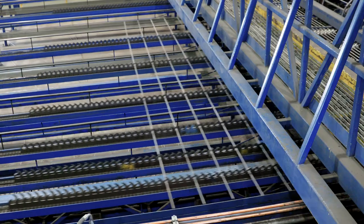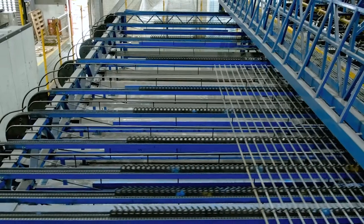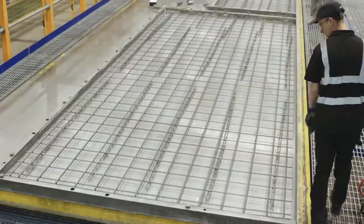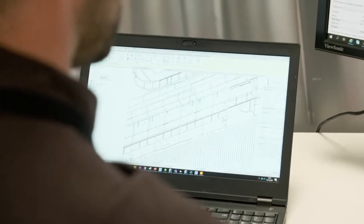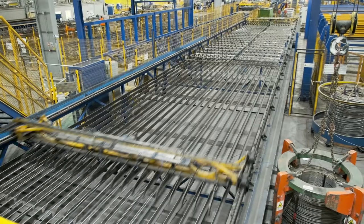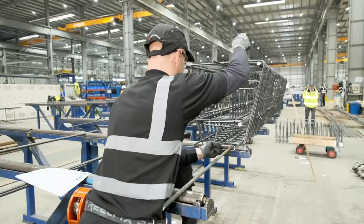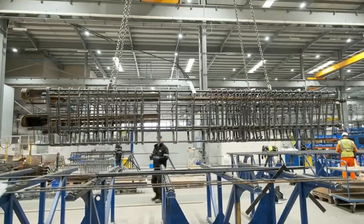The mesh machine is a key factor in our innovative approach to creating reinforcement mesh and cages for our products. The machine produces custom manufactured reinforcing mesh for all areas of the factory. All mesh produced is bespoke for a specific product, and our design office can only detail reinforcement that the mesh machine can manufacture. It produces flat meshes for the high-speed carousel, and mesh that can be folded into 3D shapes to create the basic cage for bespoke products, enhancing quality and reducing labour fixing time significantly.